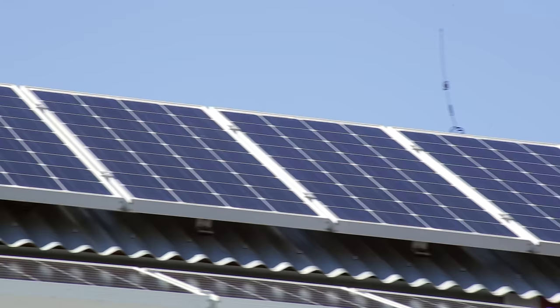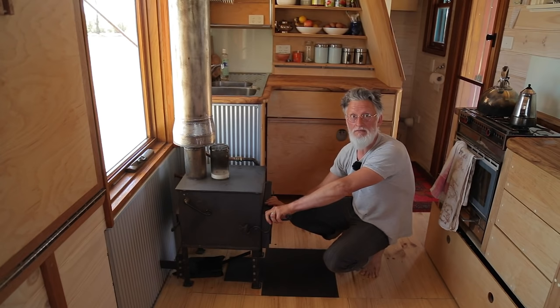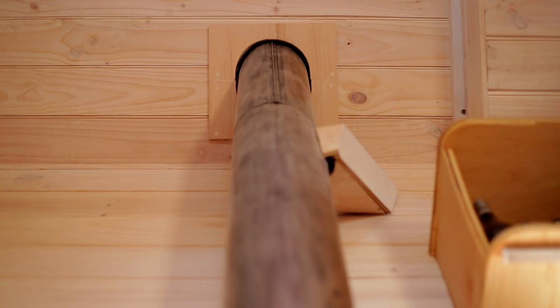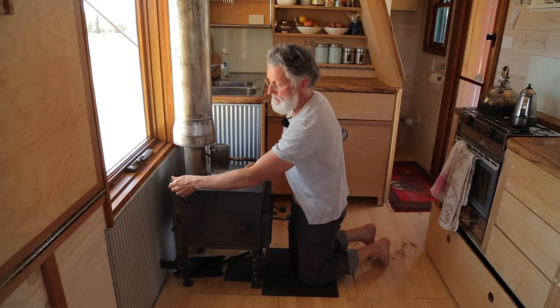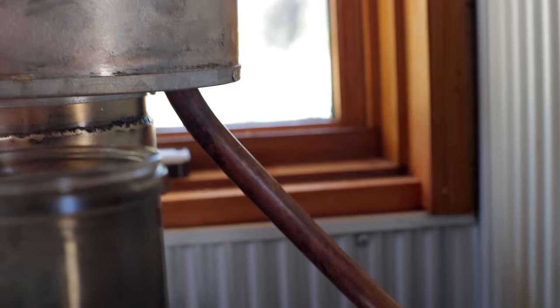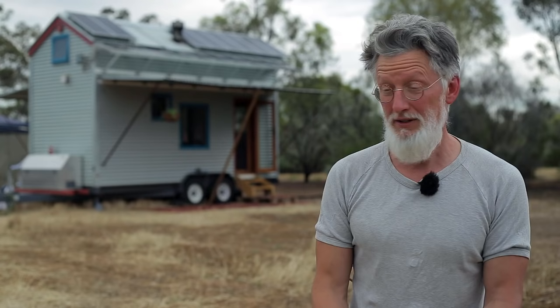There's also a piece of glass in the roof, and in that roof cavity is a steel tank attached to that glass. We fill it with water, and in summertime it gets super hot with the sun, so we don't have to light a fire to have hot water. When the fire is just getting started, a little lever lets smoke and flame go directly up the flue. Once the flue heats up and you get that nice draw, you drop it down and that forces the flame to do an S-curve past the cold water pipe. Cold water comes in the bottom, loops between the baffles, rises up, and goes back into the tank. It makes that rocket sound — you know you've got good draw and everything's working.